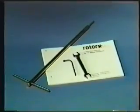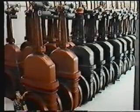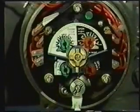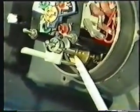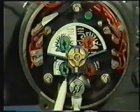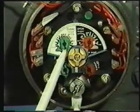If the valve is supplied by the maker with the actuator already fitted, these settings will probably already have been correctly made. If they haven't, then the first part of this video program explains how to carry them out. How to set the position limit switches so they operate at each end of the valve stroke. And then how to select the correct torque function for the valve type, plus how to adjust the torque value for your particular application.